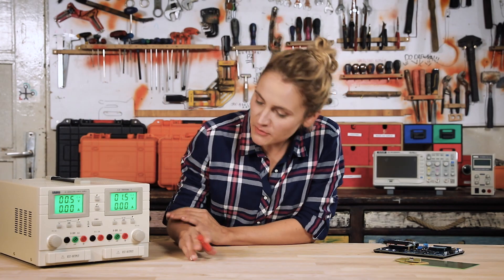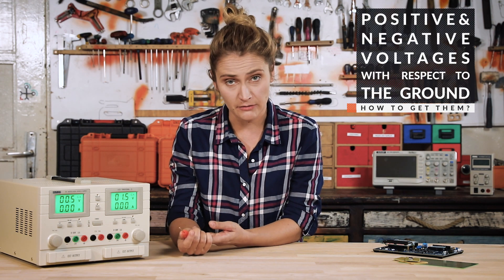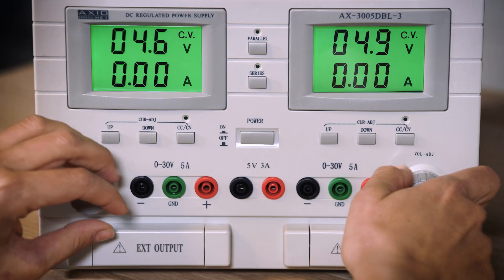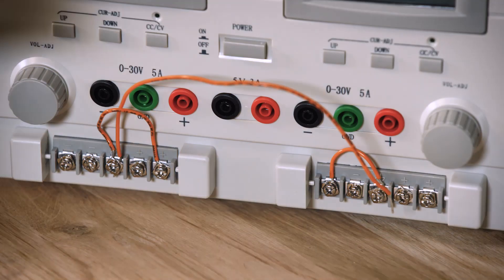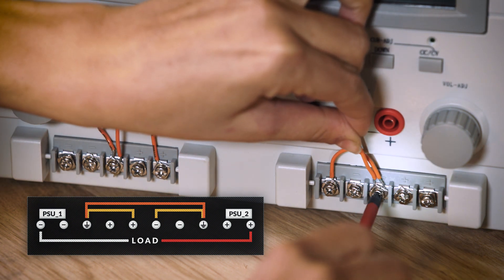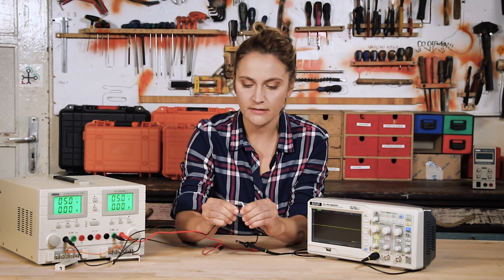As you can see, there are three ports: positive, negative, and ground. The ground port allows us to create a reference point for voltages above or below ground, or to connect your circuit to the common ground of the building. Let's have a short demonstration. First, set the voltages on both channels — let's say 5 volts. Then connect the negative port on the left channel and the positive port on the right channel to ground. Finally, connect both of the ground terminals like this.